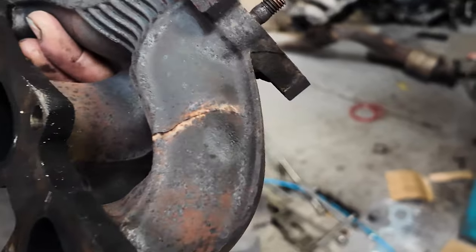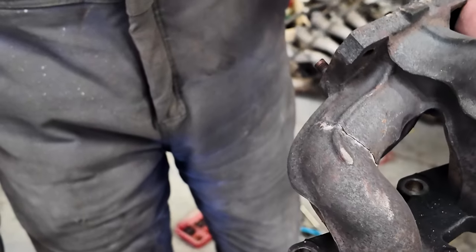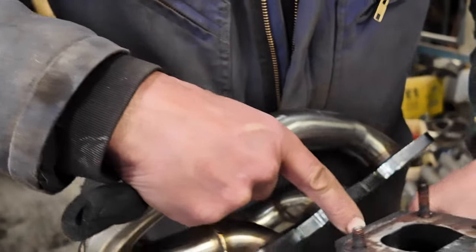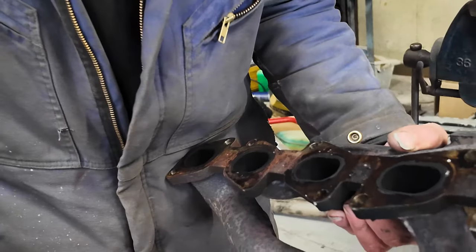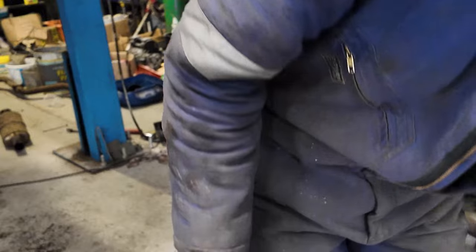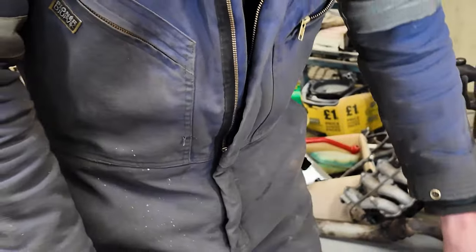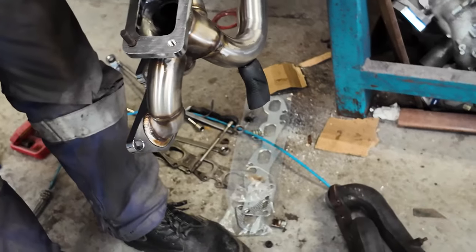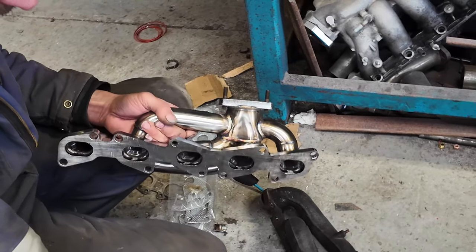Right, we've got a big crack in the manifold. And they all do that — they all do it. This is on a Fiat Coupe. They also crack through these bits. They've actually strengthened that up, but they still crack. So this new one here, two studs go in like that. But those should be opened out into holes because you've got two studs in there as well. So at the moment I can't put that on. I need to drill these holes. I don't know why they've made them like that, because you can't get these bolts.